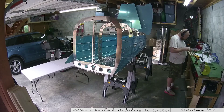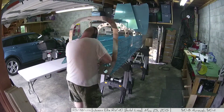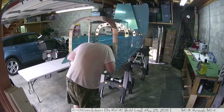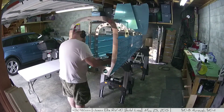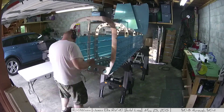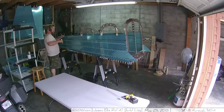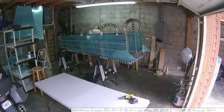I'm really behind on videos again — I've been out working on the plane itself as opposed to doing these videos. It just takes a long time to process them. This is all in section 10-9, by the way, and I'm working on all the bell crank housing bulkheads and the baggage bulkhead channel, which is that bar that goes straight up and down. Here I'm doing some match drilling on the inside where everything's in place. That's one of the themes in building an airplane — you put everything in place, match drill it, then take it out and put it back in, and so on.